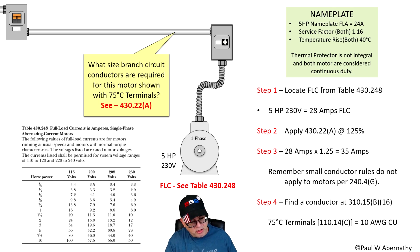Looking at the code book, a 10 gauge conductor is good for 35 amps at 75 degrees C. There's a little asterisk to the left — that's to remind you about the small conductor rules in 240.4D. But remember, G says that for motors, don't worry about that. Why? Because motors have startup inrush current, and then it comes down to running current. The rules allow for this. At a normal branch circuit, 10 gauge is typically limited to 30 amps, but for motors, things change a little.